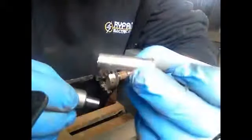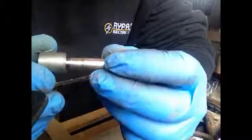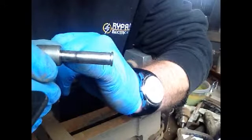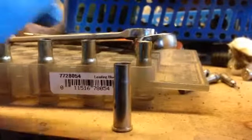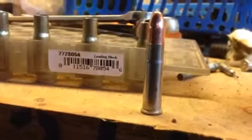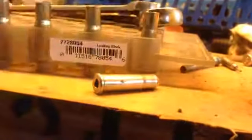I think it's gonna work quite well. This is a full-length sized case — as you can see it goes all the way up to within three mil before it fetches up, so that'll be perfect. That'll give me the bell I need for any cast bullets, and it's not gonna resize the whole thing when I want to do jacketed. Before, after it was through the expander, a .308 bullet would fall right down inside the case. Now it still pushes back in, but I expected that — it's only at .308 to start with. Anyways, thanks for watching guys.